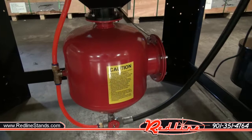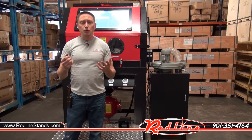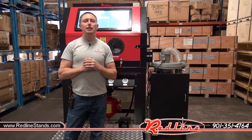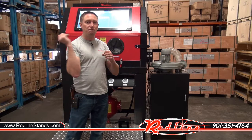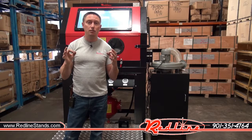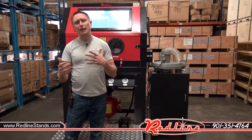Obviously, it's a Pressure Pot cabinet. Down below we've got a Pressure Pot. There are two types of blast cabinets really — Siphon and Pressure Pot. Siphon just kind of sucks the media out of a basin down in the bottom, adds a little air to it, and hopes for the best. This thing here is kind of like supercharging it — like taking your media, adding it inside of your air compressor, and then firing it out of a tube with a lot more force. So you're going to do a lot more blasting a lot quicker with the Pressure Pot cabinet. You're going to need a lot more CFM, so be expecting that you'll need a massive air compressor if you want to operate this thing continually.